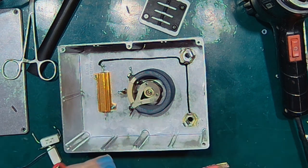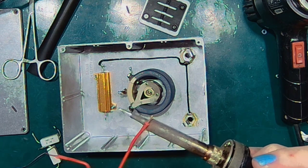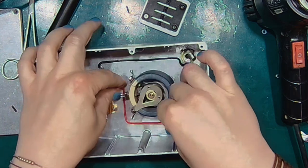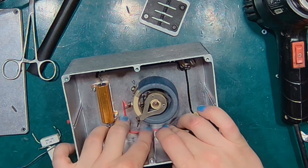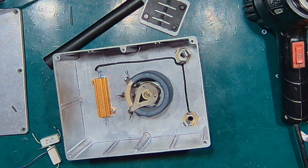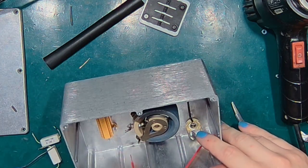And now you might ask, Kari, why do you use a heat gun for shrinking the heat shrink tubes? You can use a soldering iron just like this. But, to be honest, this is not my way because it takes forever to do. You can also use a lighter, but the results of using a lighter are not very elegant. From my experience, they burn through the insulation. That's not a nice job. So I don't use a lighter unless I'm left without any other options.